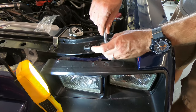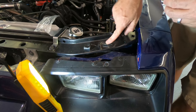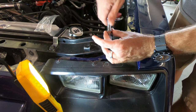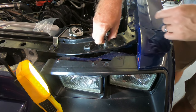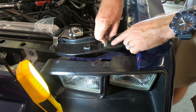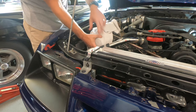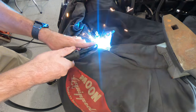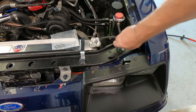The kit comes with four total — two nuts and two washers per pin. You could open this out a little bit and sandwich the stud between them inside the hole, and that would be good enough. But I wanted to weld the stud on to make it permanent, adjustable, and then use the other nut as a lock. Now I also need to open this hole up just a little bit more. You can use a file — it's very close — or grab a Dremel tool and just round it out, which will be a bit quicker.